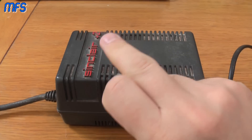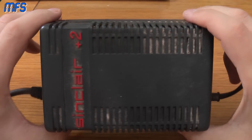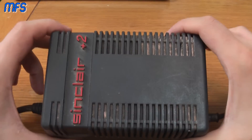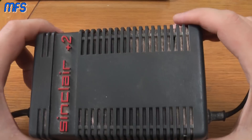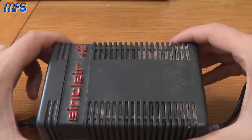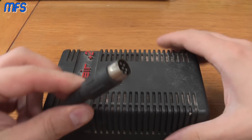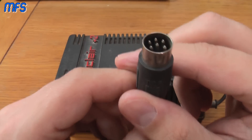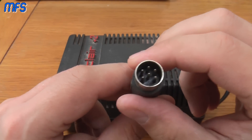And we're back. Here we are inside this unit — still filthy. You can separate the shells on these to give them a good soapy water wash or stick them in the dishwasher. First thing we're going to do is turtle it. One thing I forgot to mention: before you get too deep into the guts of the main unit, have a look at the DIN connector and make sure all the pins are there and not sheared off, because sometimes they're completely mashed from people trying to poke them in the wrong hole. That one's fine by the way.